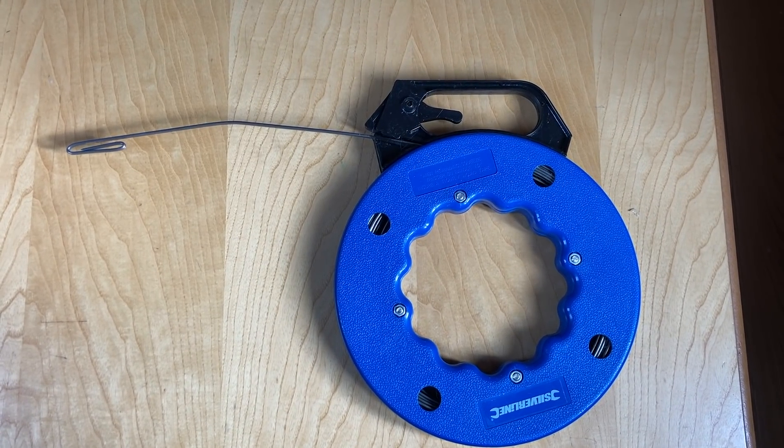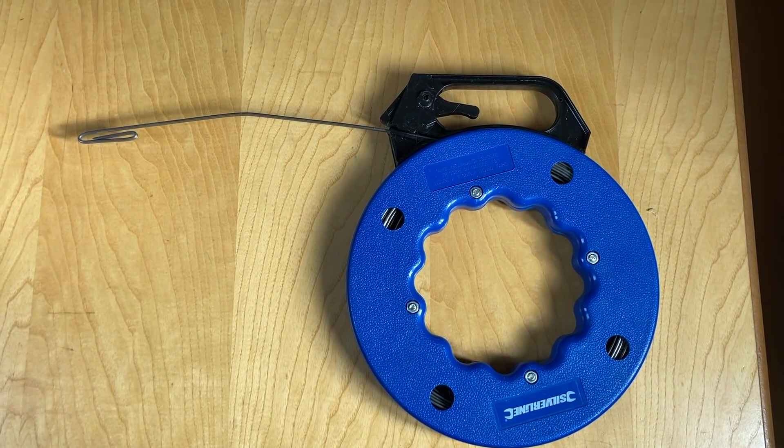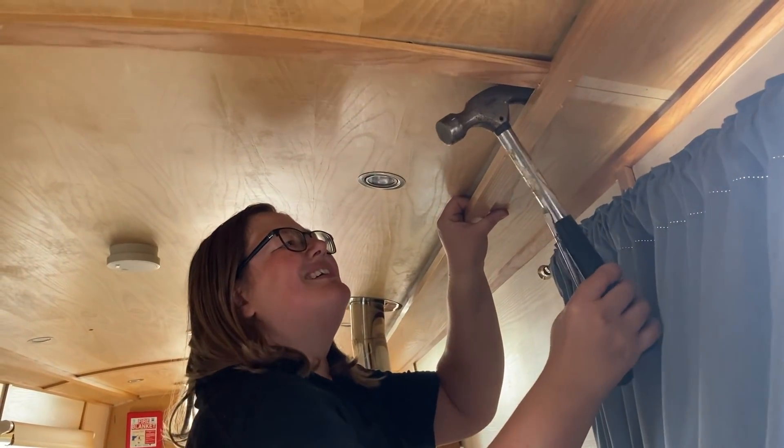When it comes to running the cables, if your narrowboat is already fully kitted out, you might need a fish tape — great for hooking and pulling cable through without having to take the interior ceiling down. I also purchased stainless steel washers and nylock nuts for attaching the solar panels to the rails, and we used a lot of Sikaflex to glue down the flexible feet.